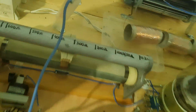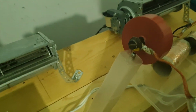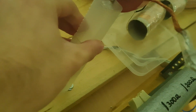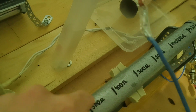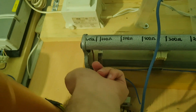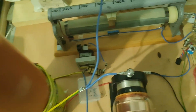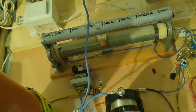You also see here this insulator that I've made. I think you put drill bits inside of there or something, and this is actually adjustable. I have it on the maximum setting to provide maximum clearance because this is metal, and because you can arc over from here to there, you can also arc over from there to there because this is basically right across the primary, so you want as much voltage isolation as possible.